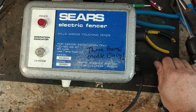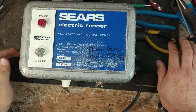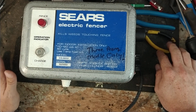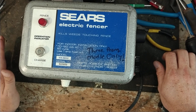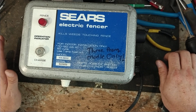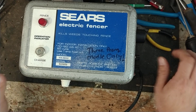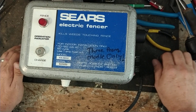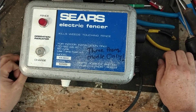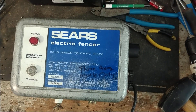That's what drove out a lot of the solid state stuff. Eventually, by the eighties, everybody jumped on board with low impedance. Now everybody does low impedance, wide impedance, ultra low — whatever you want to call it; it's all the same idea. Everybody does it a little bit differently, but it all uses those big capacitive discharge circuits through a multiplier or a step-up transformer on the board.